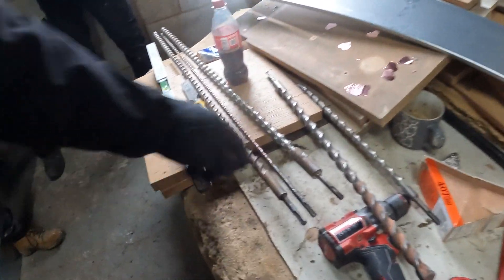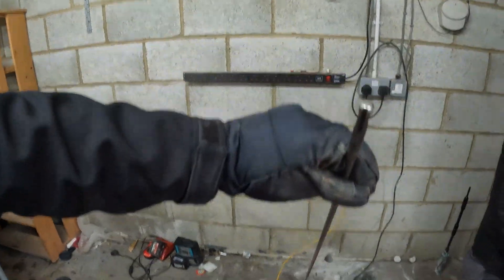Right then, this video's turned into the nightmare core cut hole. So what we're going to do is pilot this — send it through in a minute. We've got a nice little 10mm bit, we'll send that through, it should pop through. And then when we send the bigger one through, it should have weakened it enough — it should just crumble into the hole, hopefully.